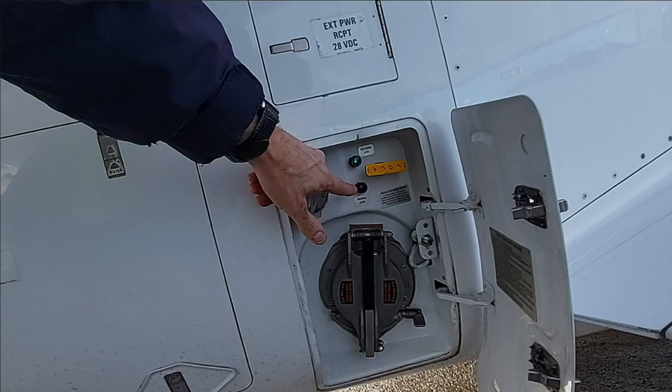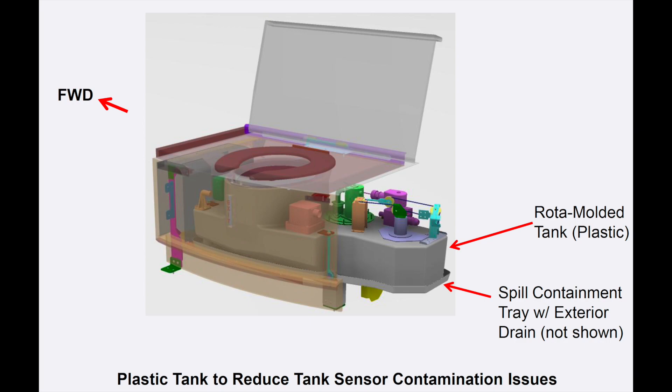The red LED light means it is overfilled or the filter is blocked — in our case most of the time it is when the filter is blocked. If that is the case, you want to clean the filter by holding the push-to-flush button in the toilet so the toilet servicer can automatically fill the toilet, then flush it a couple of times and empty it again. If that does not solve the problem you can also use hot water — don't use boiling water as that might melt the plastic inside. Also a good idea is to brief the passengers about the toilet bin location so they do not throw away towels or even diapers, which we have found in the toilet and which definitely block the filter.